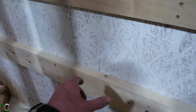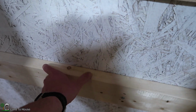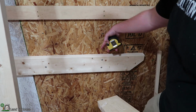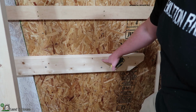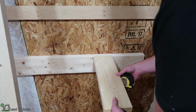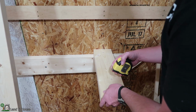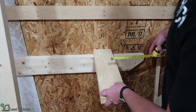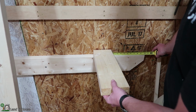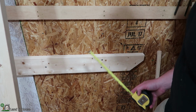piece, and then I'm going to have 3 support beams. So I'm going to have one here in the middle, and then on the end as well. I'm going to want the first 2x6 to be anchored down on either side of this bolt here. And so right here is where I want this to be. So let's see how long this piece needs to be here. 10 inches right there. So let me cut a 10-inch 2x4.